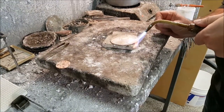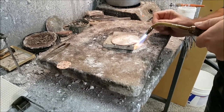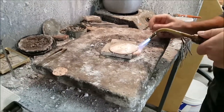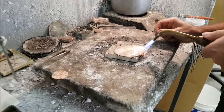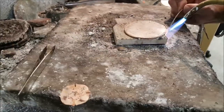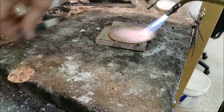We're back — we've got all our pieces cut out and Greg's got a rope shaped here around the outside of the blank. Once the buckle gets hot we start to add the solder, which you can see Greg doing here. When the buckle gets hot enough that solder just flows right around the outside of the rope and holds it all together.